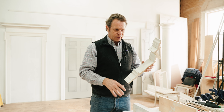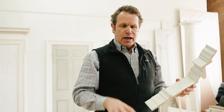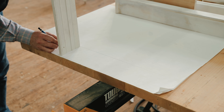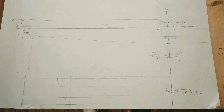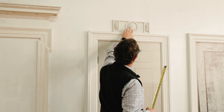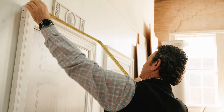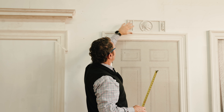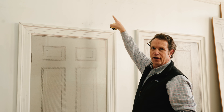I made up this little example here, and what we're going to do is draw this out — how it's going to lay out — because drawing it out on paper really helps you see it in your head. You end up building it on paper before you build it on the wall, and it really helps out. I've got this panel that's going to sit on top of my frieze. This whole assembly goes in here at 39 and 3 eighths. I've got to cut the back piece of the frieze, the panel sits on top, and then the cornice goes above that.